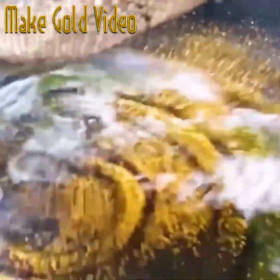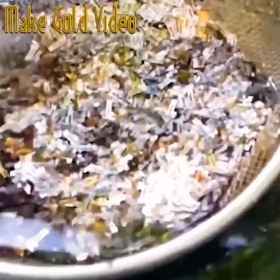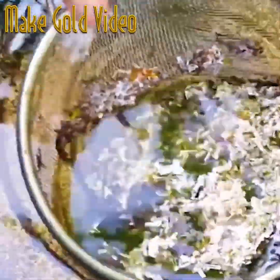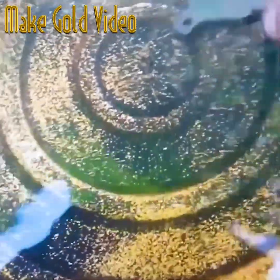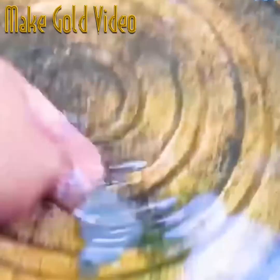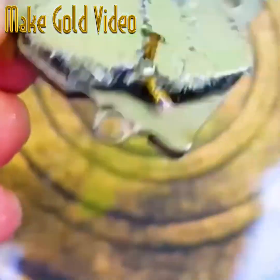The soak uses a 68% nitric acid solution — five liters of it mixed with five liters of water. Then it's run through a colander, making sure to only let the gold dust and gold particulate through, to remove any remaining scrap metal that are considered impurities. In this case a magnet from the hard drive itself is used — just check that out pulling up that scrap.